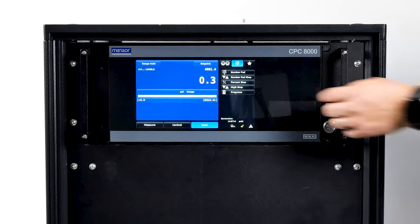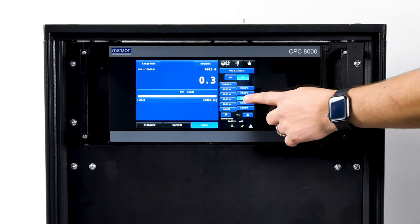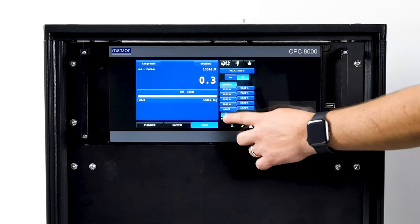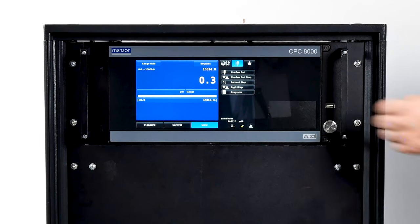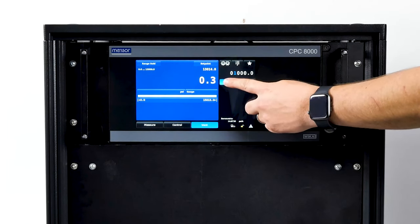Next, we'll take a look at the percentage entry method. The percentage method allows the user to select a setpoint value as a percentage of the pressure range of the device under test. Once you choose a percentage, the setpoint will instantly change to that selected percentage value. The up and down arrows at the bottom right adjust the setpoint by the current digital step amount. The DUT minimum and maximum range, as well as the number of percentage steps, can be modified in the step settings application accessible through the range button. In the digital step data entry mode, you will see a string of five white zeros and one blue numeral 1 across the top. Any one of those zeros can be converted to a blue 1 by touching it. Use the up and down arrows to increase or decrease one digit at a time.